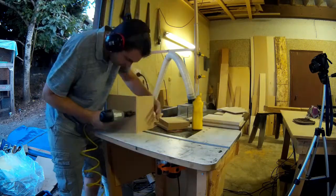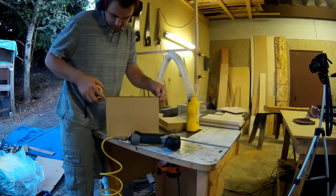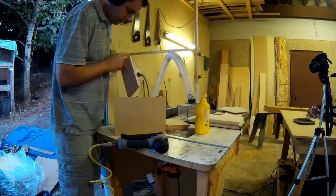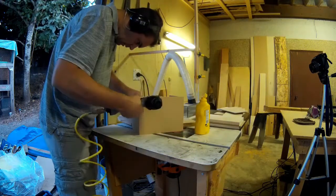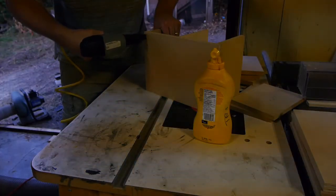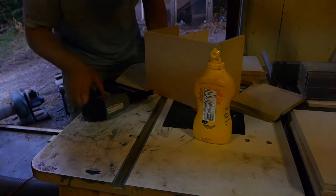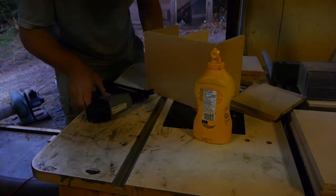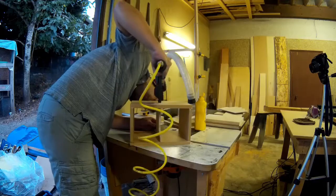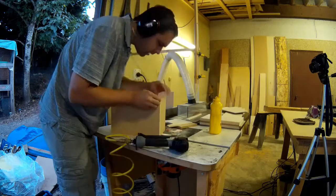Here I am assembling it. I'm going to use some leftover laminate from a previous video, so I'm not worrying about nail holes or seams. You'll notice I keep all one side registered against the table — that's going to be the baffle side, which keeps everything perfectly flush, and any little inconsistencies in the cuts will stay towards the back. Here I am in real time showing you operating the nail gun. I do go slow and take my time, always making sure my fingers are clear.